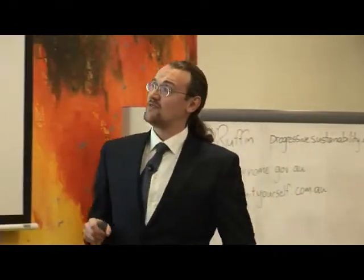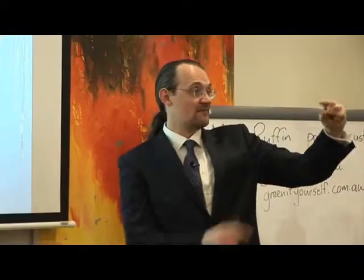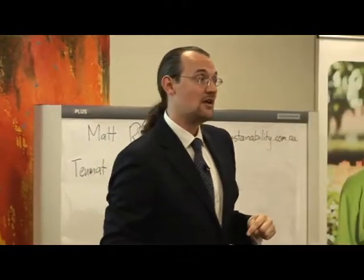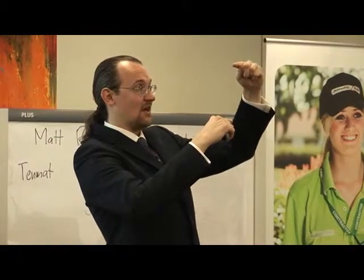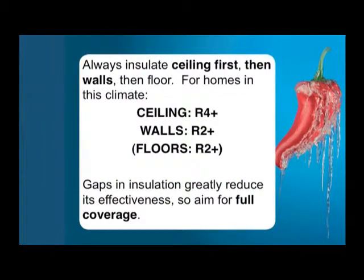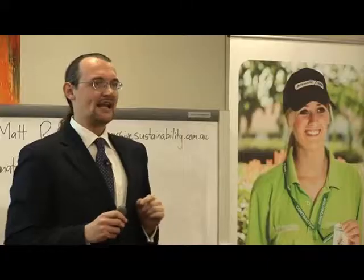A rough rule of thumb for standard bulk insulation materials: R1 is about 5 centimetres, R2 is about 10 centimetres. A lot of Canberra houses have R2 or R1. R2 will just about come up to the ceiling joists. R3, R4, and R5 are progressively thicker. Now in this climate you want at least R4. The standard is actually now R5, but if you've got R4 that's doing most of the job of R5, so I wouldn't spend a lot of money upgrading from R4 to R5. If you've got R4 or more, you can leave it. But if you've got less than that, I would be adding insulation to your ceiling.